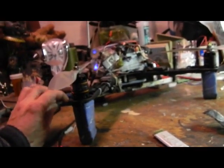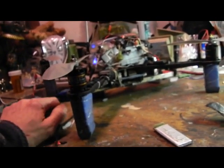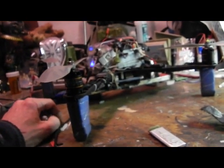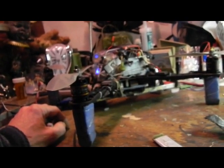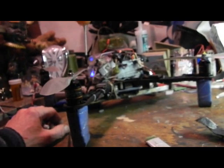I had a prop rotating the wrong way today, and I thought that I had screwed up the controller board with the crash that I had into a tree, but it turned out that the prop was set up wrong, and I've put these props on hundreds of times in the last year. So always check carefully, and then also your baro.